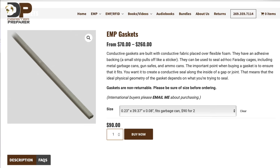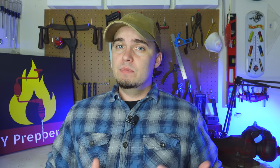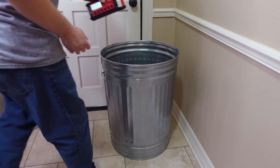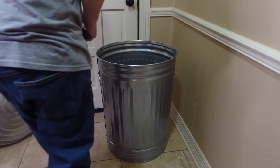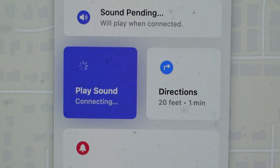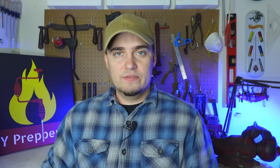The next thing you want to do is add a gasket to the top of the can because even if the lid fits really well, there's still probably going to be at least some small gaps. You can buy special conductive gaskets specifically for this, but they can be a little pricey and you usually need to order them online. For mine, I just used heavy-duty aluminum foil folded over itself a couple of times and placed on top of the can. The can without the gasket did a decent job blocking radio signals, but cellular signals went right through — I placed my phone inside and was able to activate the find my phone alarm from my computer. But when I added the foil gasket, I wasn't able to do that anymore.